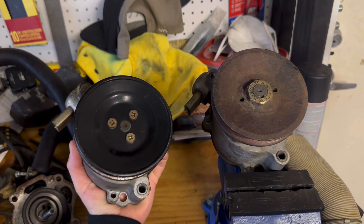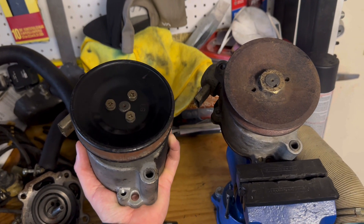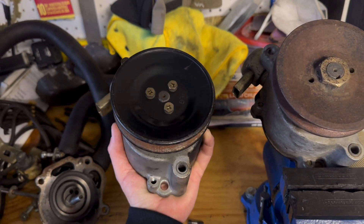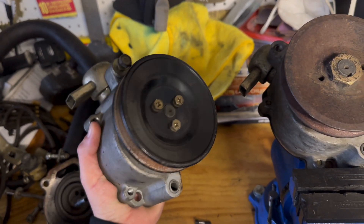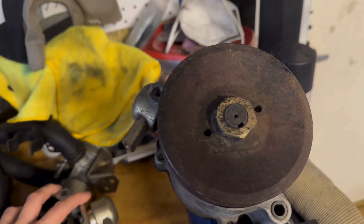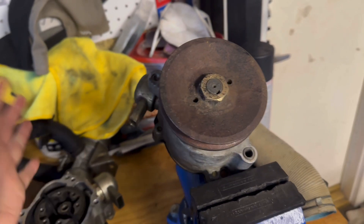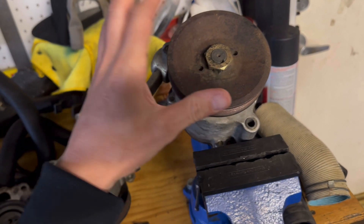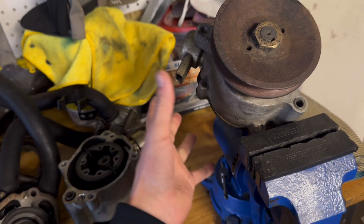But if you're rebuilding your pump, it's essentially the same process and I'll drop a link in the description for the replacement bearings if you want to do it yourself. You can definitely change them while it's apart. There are two different versions of this pump: the early version, which has a single nut, and the later version, which has three 10-millimeter bolts. Now this nut on the older version is going to be reverse thread. From what I read online, they went to the three-bolt design because people were trying to disassemble these and stripping out the shaft, rendering it essentially useless.